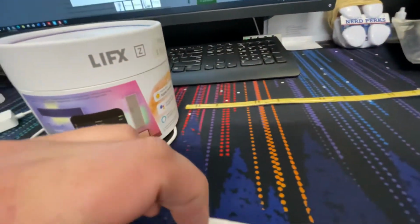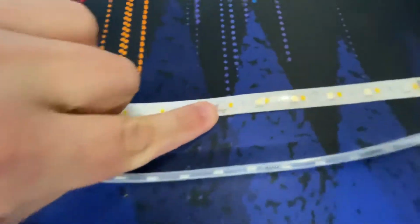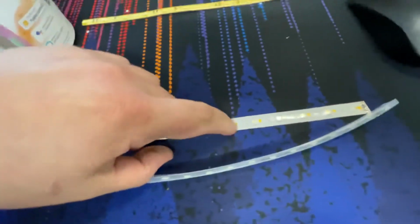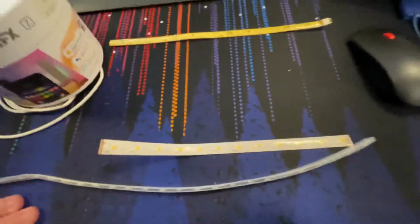So you might notice that there's an LED there that doesn't have any of that plastic stuff around it, any of the silicone stuff. It's because I had to cut it away. That one LED died and I had to replace it. So that again was the control LED with that chip. Because I already had at that point a dead strip, I had to transplant a functional LED with a control chip onto that strip, and that did fix it. I shouldn't have to do that, but that's what I had to do to get it to work again.